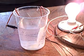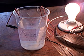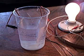Turn the switch on and you should slowly start to see the light bulb dimming. You notice there's bubbles coming off of one of the plates — that should not happen once the oxide layer forms.